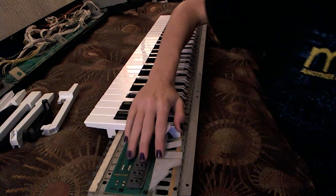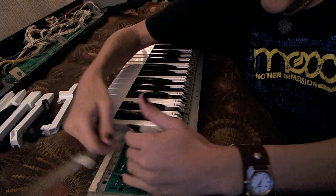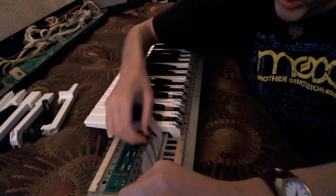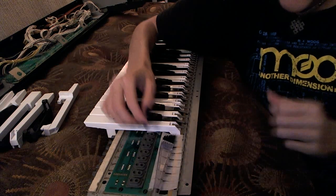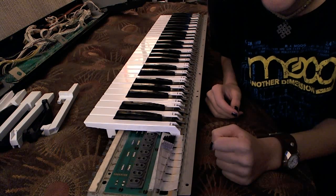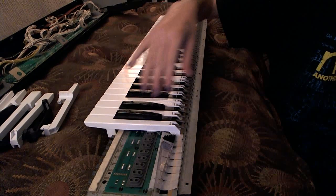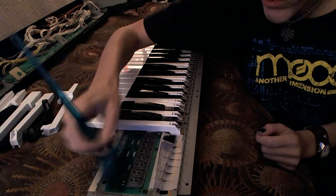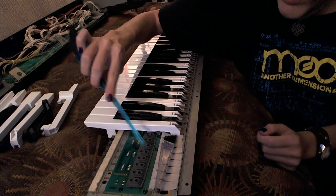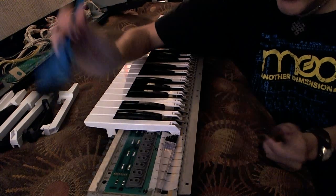Here are the plastic paper tabs. What I normally do is take a paintbrush with a decent weight to it and actually keep the paper tabs from flipping over while I'm working on it. I'll set the paintbrush in it and put the paper tabs over so I don't have to worry about it getting in the way. Before pulling the contact strips up, I'm going to give it a quick cleaning so that any dust on top — which does settle into these little holes — won't get onto the sensors when I pull it up.